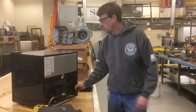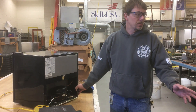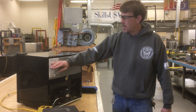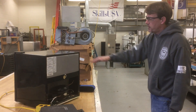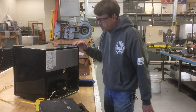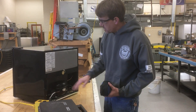This is part two of the refrigerator troubleshooting series - it's a mini fridge. With the level two students, I've already gone over the wiring diagram, which is pretty similar to those water coolers we've been taking apart in the classroom. Somebody brought in this fridge, and I already put up a 15-minute video explaining how the refrigeration system works. We also discovered by using the amp meter that the compressor was locked up.